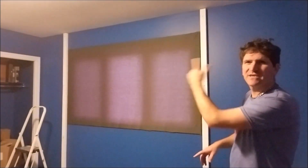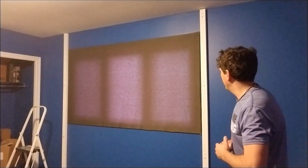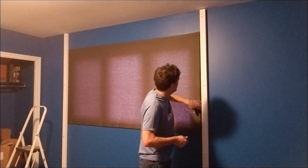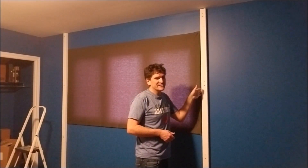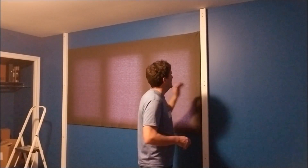I have the first two vertical boards up. That was quite the chore and I made a few mistakes. If you're putting boards up against a window like I was, do not put them right up against the window frame — there's a bit of a stud hanging out there, and if you try to use an anchor of any sort that opens up behind the wall, it won't work next to the stud. I ended up moving it over about half an inch out from the edge and that worked.